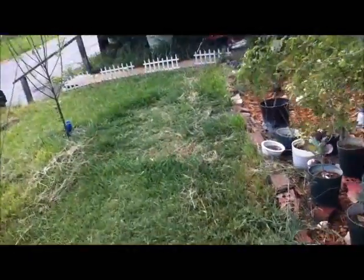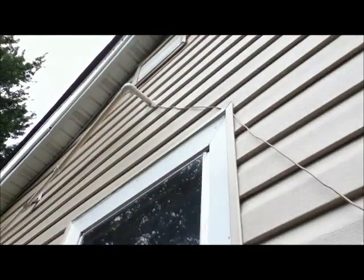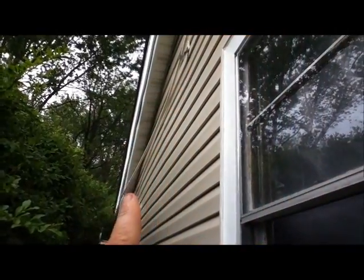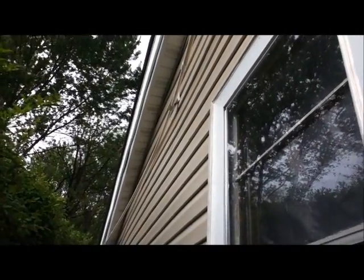On the other side of the house, here's another water-saving project. I have central air — a heat pump — and the condensate line comes out from the attic right there. What I did is put some PVC on it and ran it to the gutter in the back of the house. Because that outlet is higher than the back gutter, it drains into the gutter, and then it drains into that rain barrel I showed you earlier, which feeds the irrigation system.